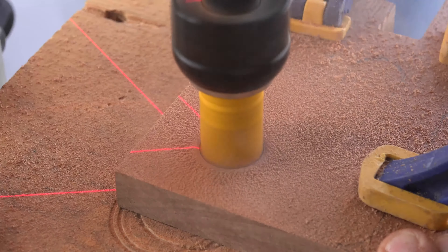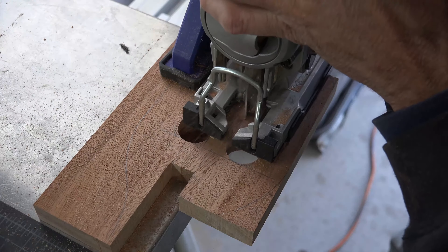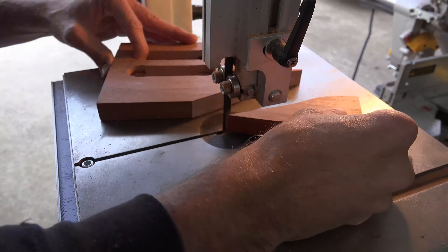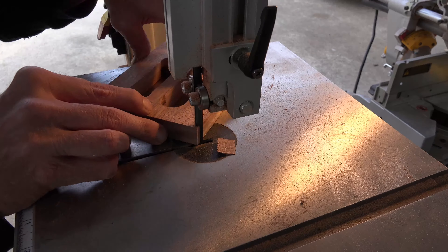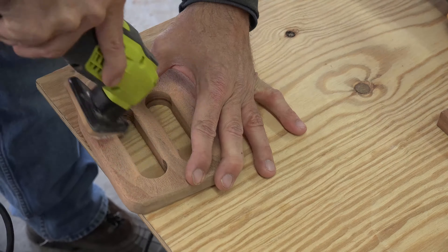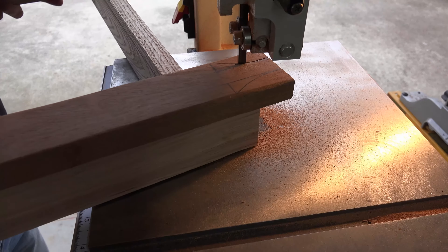Find a hole saw that fits perfectly between your two cut lines and cut out your groove. Do not extend past the back line. Then with a jigsaw or bandsaw, cut out the remaining corners. While you still have your hole saw set up, press out your strap eyelet corners. Since I was making both sides at the same time, I continued to cut out all eight holes. With a fine wood-cut jigsaw blade, connect your holes by cutting straight across on each side. Now you can go back and finish cutting out the rest of the shape — the reason we waited was because we needed the extra length to clamp down on while we were cutting and drilling. Cut all remaining straightaways on the miter saw, then switch back to your bandsaw and round off all your corners. With the strap in place, trace out your sides, then with a protractor make an even mark an inch away from the tip of the strap and round them out. With a jigsaw or bandsaw, cut out your marks.